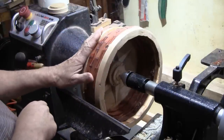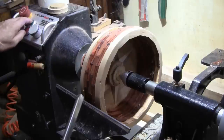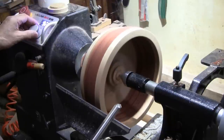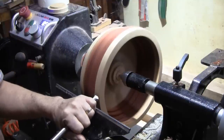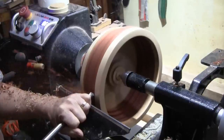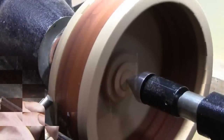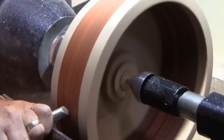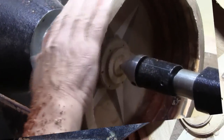Now I need to create a shape and find out how much I can cut on the inside. That disc on the inside is hot glued on there, and I turned the tenon on it at the beginning so I could flatten the bottom out and get another disc hot glued on there with the tenon — that way I could start the glue-up. I left the disc on just so I could have the tail stock support. I'm going to clean the inside up before I go any further.